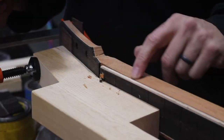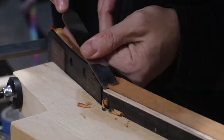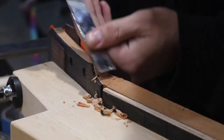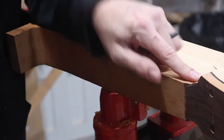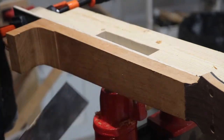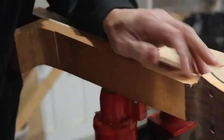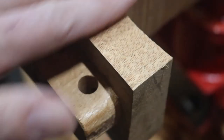This side is almost flush — just a little bit over — but I can't get all the way through with my plane, so I'm working on it with my chisel, slowly getting it down to the same level as the back. I'm taking it really slow; I don't want to accidentally mess something up. I've gotten as close as I feel comfortable. There's a little hump, so now I've got a thicker scraper to get this down flush, even with the binding. I'm keeping it pretty straight and now this side is pretty much flush.